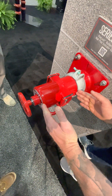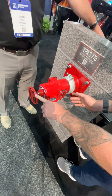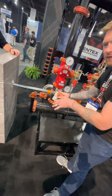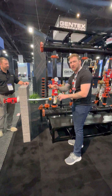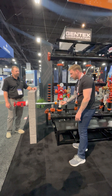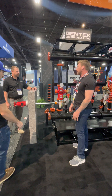So this comes pre-sized with the right amount of revolutions based on the correct turns. And it connects to a butterfly valve. Just think about when you're installing a PIV or wall post indicator valve — you also have to do the tamper, usually on the outside. Why not use the tamper on a butterfly? It's already there. You also have the target so you can know if you're open or closed.